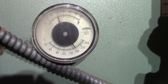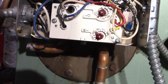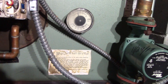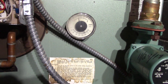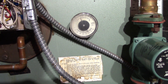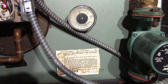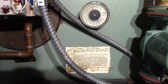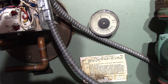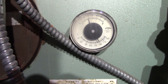You can see it's at about 180. The high is set at 195, so per Honeywell — the manufacturer's Aquastat — if the circulator pump is running right now (you probably can't hear it, but it is running), and the thermostat is calling for heat, this should fire at 10 degrees below the high. The high is set at 195, so at 185 it should fire.